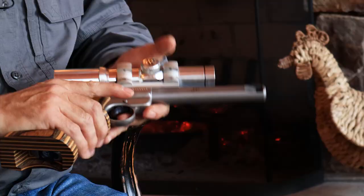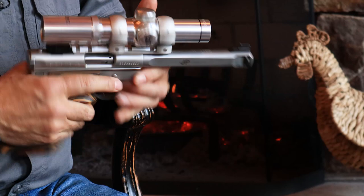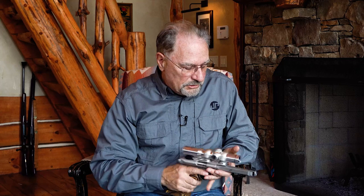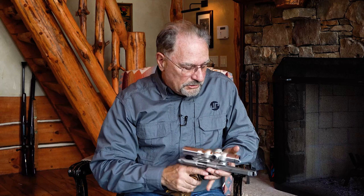We even started doing this on some pistols. Here's a Ruger target model with the same technique on the barrel. We also had the ability to back-cut it, which allows the high-pressure gas to hit the forward surface and then dissipate quickly against this wedge without hitting a rearward surface, making it more efficient. That's the theory we applied to all our compensators — always making that back cut to let the gas escape without applying energy toward a rearward surface and depleting efficiency.